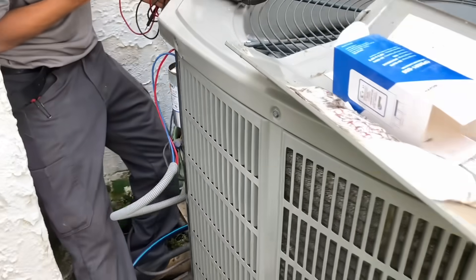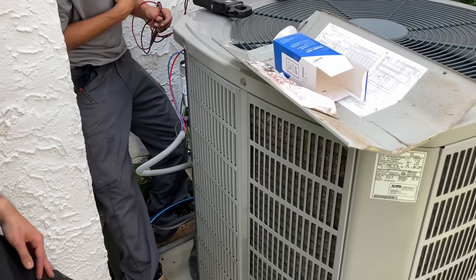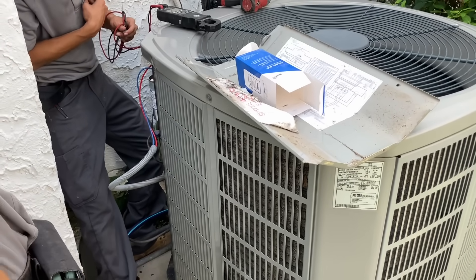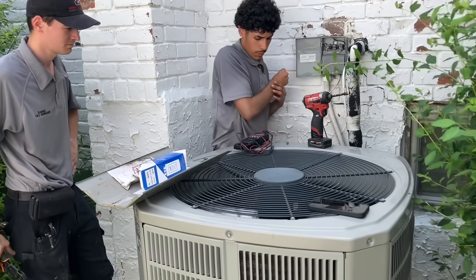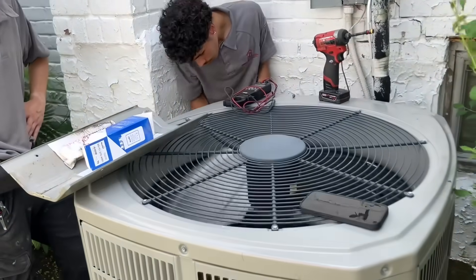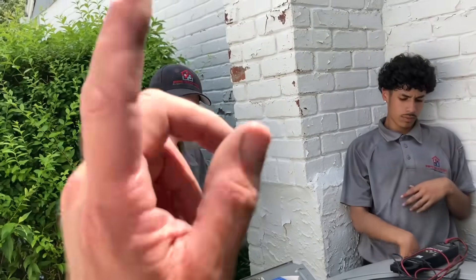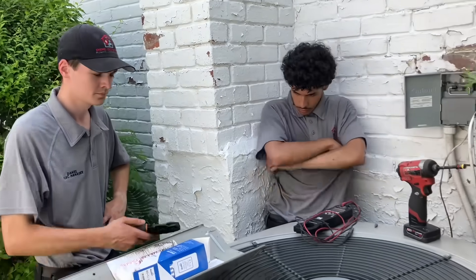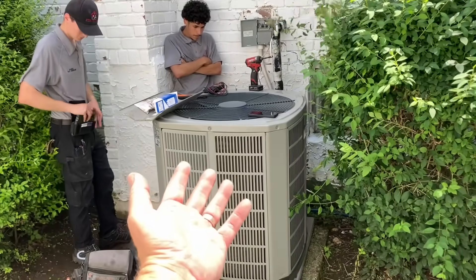Compressor — open fuse. You know what, I would remove the soft start for right now and see if — or we could test the windings on the compressor. And yet another video where the soft start killed the compressor. They're gonna be hating — this is number three: soft start killed operation of the compressor. Come on, you guys don't like clickbait.